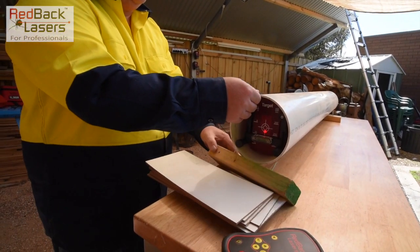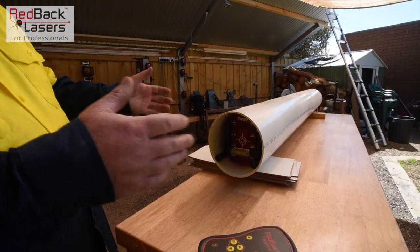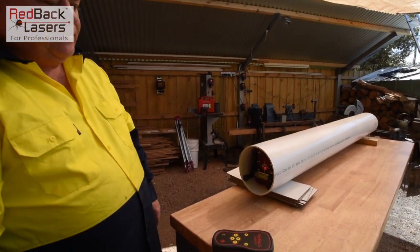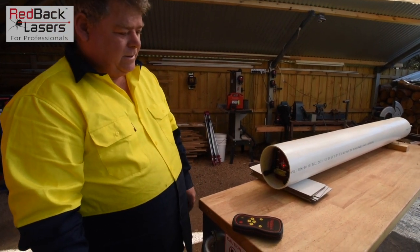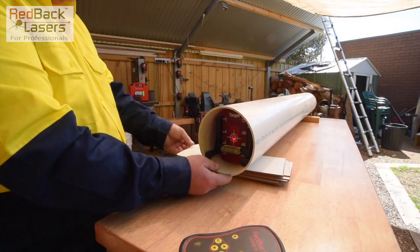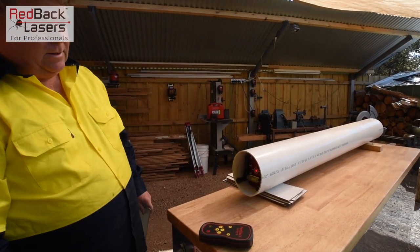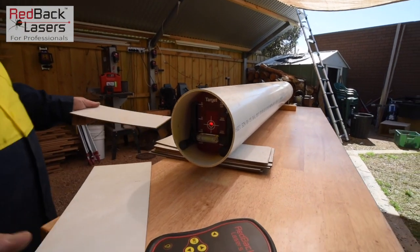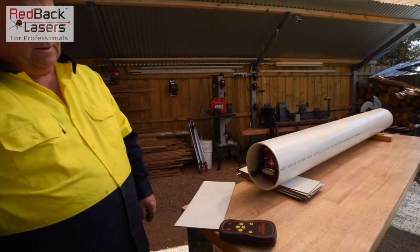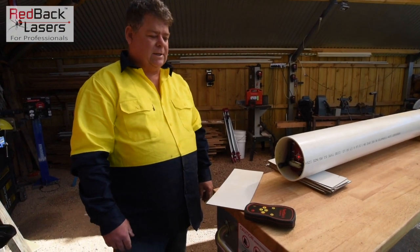So I'll put some packers on. Obviously I've shifted the pipe, but the pipe laser is set inside the pipe so it's just moving with me — it's re-leveling back to grade. At the moment it's showing I need to bring the pipe down a little bit further, so I'll take out a couple of those packers. It's re-leveling again. Now we're going to go the other way, so I'm going to put a packer back in. Now we've got our laser shooting into the centre of the bullseye of our laser target.